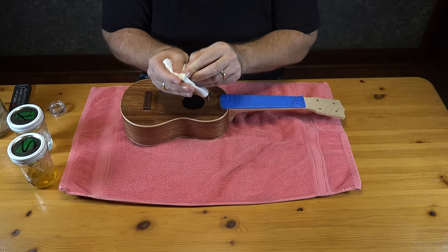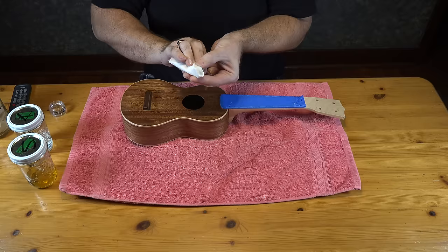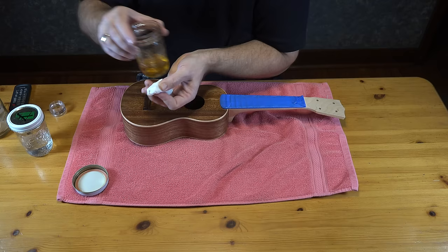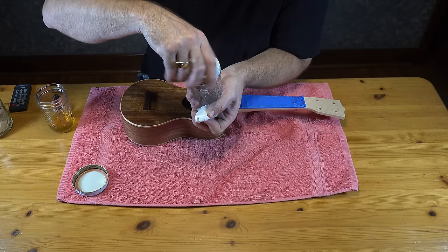So let's go ahead and lay on that third bodying process. We've got our pencil eraser in here. We're just going to pull this linen tight over our pencil eraser, just like I said. And once we're pleased with how the surface of that looks, you want a crisp corner in here. Once you get that all straightened out, you just want to get your alcohol and your shellac.